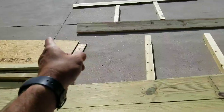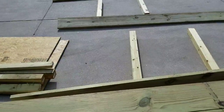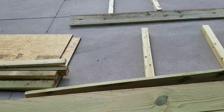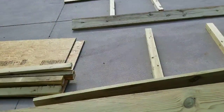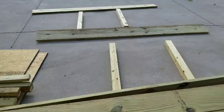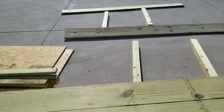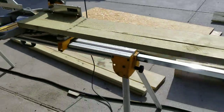They're gonna be 10 feet, but as you know, no wood is true 2x4x10. I mean 2x10x10. So we're gonna cut it, it's gonna be 2x10, the height, which is not really that. But it's gonna give us about 118 inches. Not truly 10 feet, shy about 2 inches or so. But I just wanted to make it squared, and 118 is going to be the ticket, the winning number.